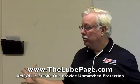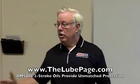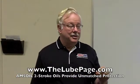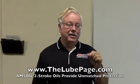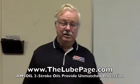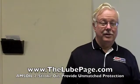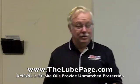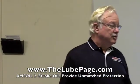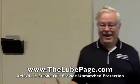So if you know anybody that's got boats, and these Evinrude E-Techs are super engines, they're moving across the boat community at a pretty good rate because, guess what? You get a 220 horsepower Evinrude E-Tech and compare it to a 220 horsepower V6 Johnson with carburetors, it only uses about 45% of the fuel that the Johnson carbureted engine used. So you can imagine people that boat a lot, why they're moving to these direct injected two-stroke engines. They want to be able to go out and not spend $200 on fuel for the day, you know.